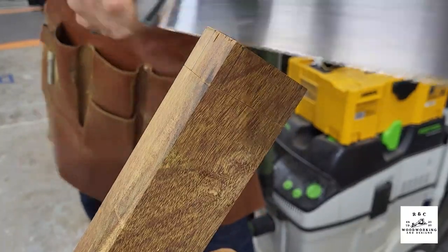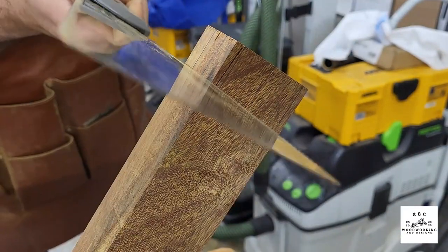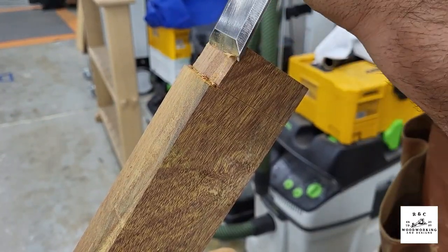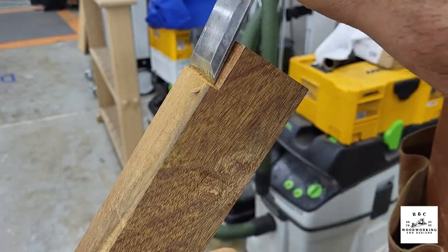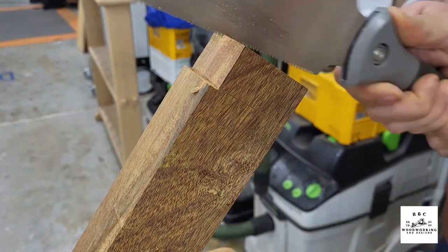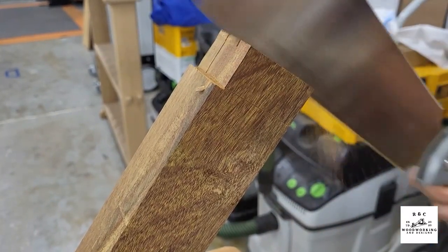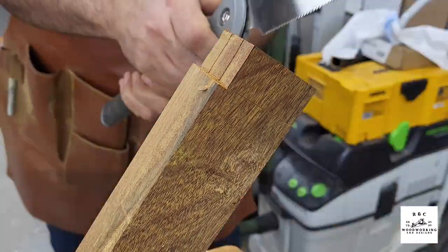This is where I tried doing the cheeks first, and I found it wasn't nearly as clean — I ended up having a lot more overspill onto the rest of the shoulder, and it involved a lot more cleanup. Now, because this is such a dense, hard exotic wood, I ended up actually having to sharpen my chisels and scrapers at least once a day, if not twice. There was actual sharpening that had to happen every time. This wood fought me from start to finish.